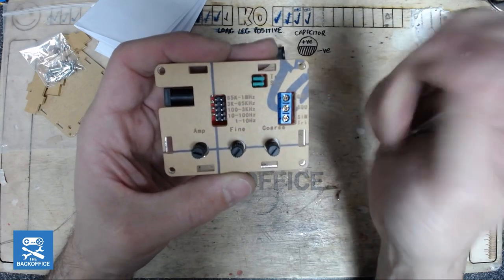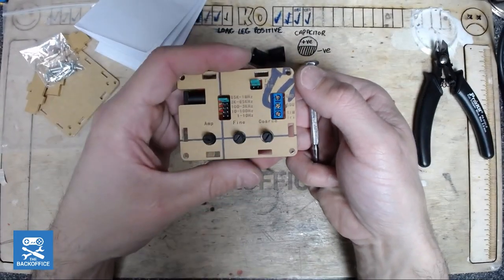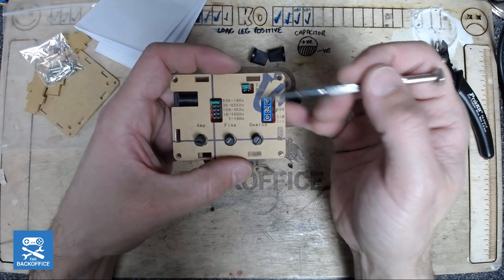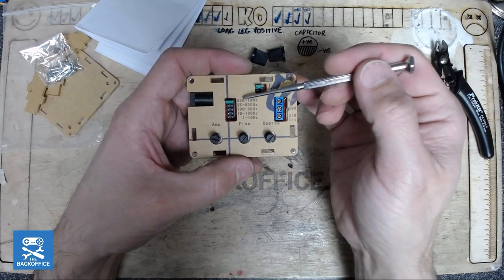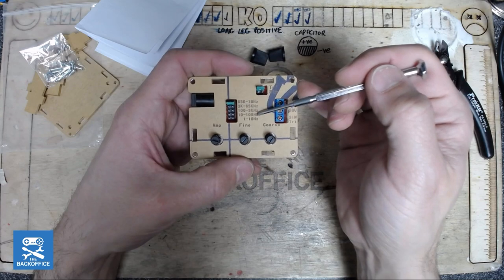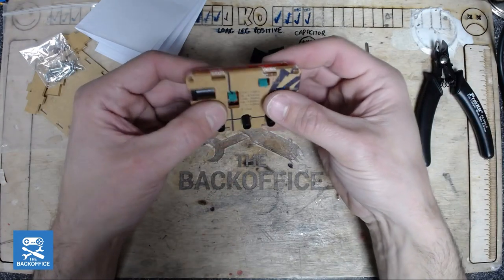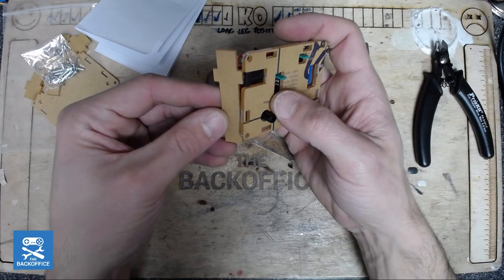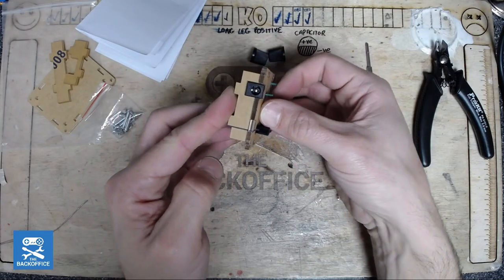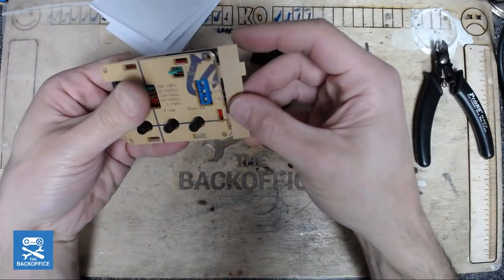And then the various jumpers. Oh, I'm such a knob hole. Look, you're supposed to have it like that, aren't you? Okay, I'm not going to bother hooking it up. It would probably work now. But look, you're selecting if you want a triangle or sine wave on the adjustable output, and then you're selecting the frequency here. So 65k to 1 meg, 3k to 65k, 100 to 3k, 10 to 100 hertz, 1 to 10 hertz. You've got the amplitude, a fine adjuster, and a coarse adjuster. So that's actually nice. Cool. And once you get all the thing built up, let's see how this would look. It's even got all the sides and everything on the case when it's assembled. So that's like a proper thing that won't get damaged by your dirty dick beaters.